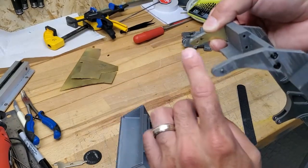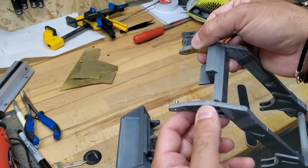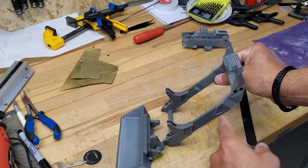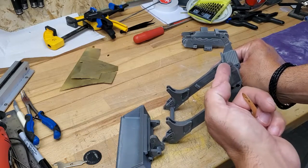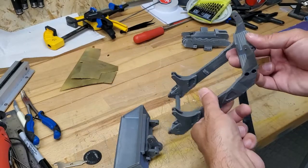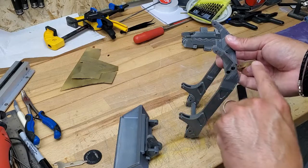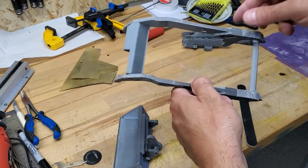If you don't want to do the brass reinforcement, make sure you use 100% infill — that will help. It's really dependent on how you're printing it. You could print it more vertically with more supports, and the way the printer lays down lines in that direction will give it more strength vertically through the piece, rather than horizontally as I did.